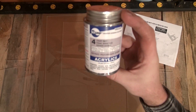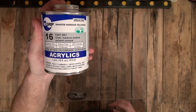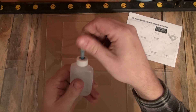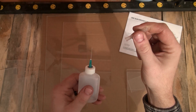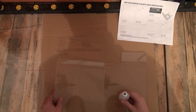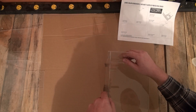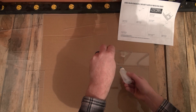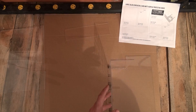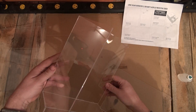After you have all the panels cut we will assemble them using some acrylic solvent cement. I will be using a water-thin fast solvent number four initially and then follow that up later with a thicker number 16 cement to strengthen the joints. You can find links to where I purchased both of these in the description and in my linked blog post. I also purchased both of the applicators from Amazon as well. Lay the pieces on cardboard to soak up any excess solvent as you work. The solvent has a set time of about two minutes so once applied you can make small adjustments but you will need to work fast. The joint will not reach full strength for 24 hours so even after it is set you will still need to be careful at first.